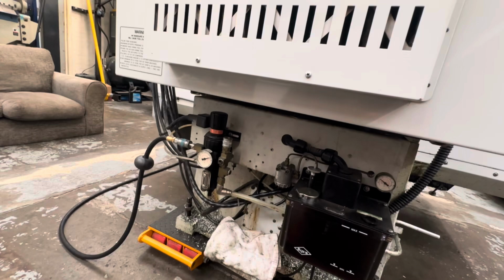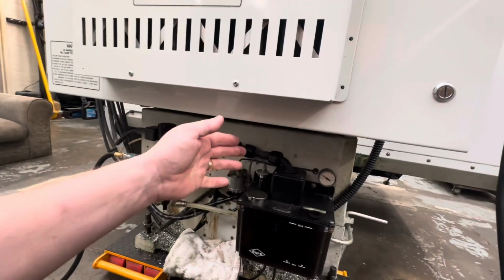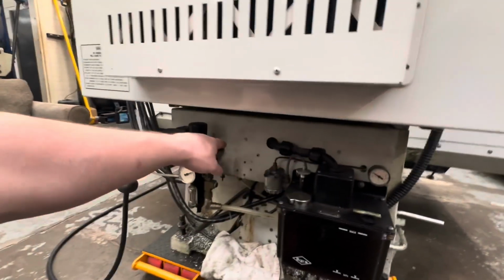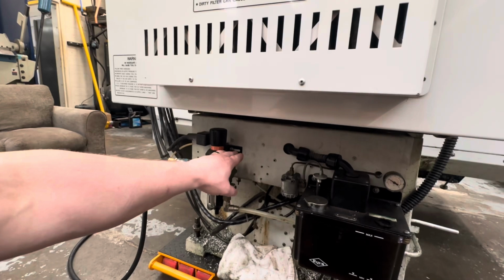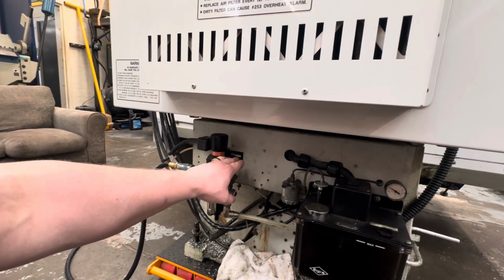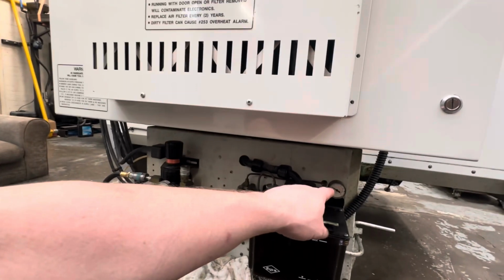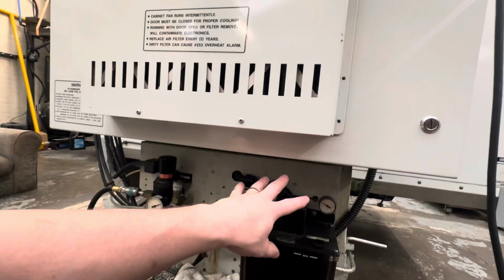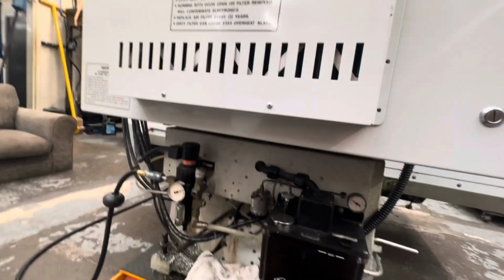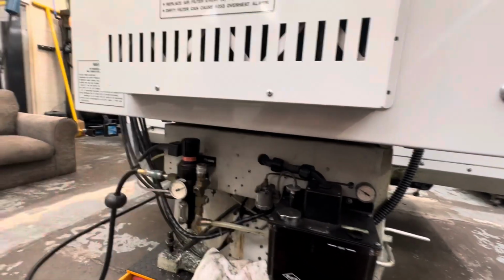But what I'm going to do is I'm going to have to trace it back around the system to find out. It's got to be held up before it splits off, I'm thinking. So immediately behind here, I think is where it's gummed up, because I'm pretty sure it's not going to be blocked on all three axes, causing that to back up. Because if it got to all three axes, even if two of them were blocked and one wasn't, you'd still get a pressure drop, and we're not getting anything. So that tells me there's an issue immediately behind here.